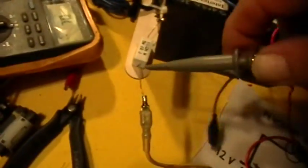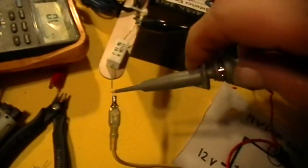0.2 ohms indicated for the test leads themselves, right? So those are both 1-ohm resistors to the nearest tenth of an ohm, right? Am I right? Are we agreed? Okay, so now I'm going to take the channel 1 oscilloscope probe here, and I'm going to hook it to the wire-wound resistor like that, right?